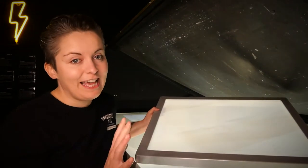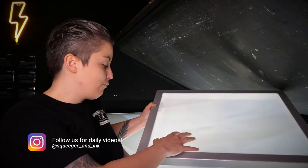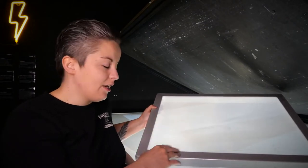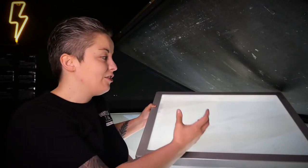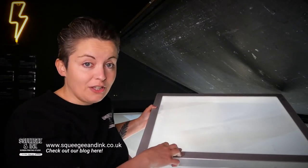The first tip definitely has to be checking the tension on those screens — preferably using new screens or high-tension mesh — and you also want each of your screens to be of a similar tension. The professional way of monitoring that is to use a Newton meter held in the middle, and it'll literally read how many Newtons are being held by that mesh at that point.